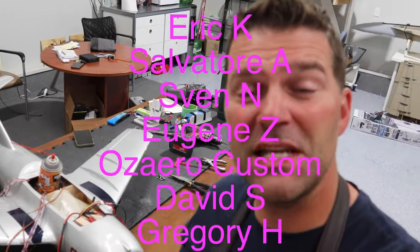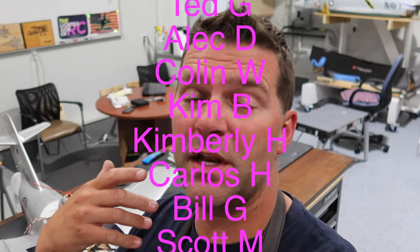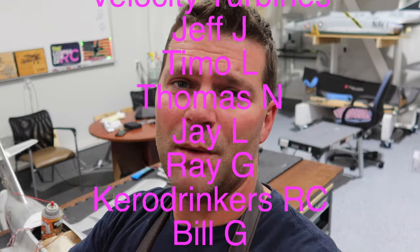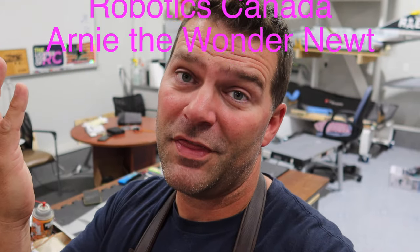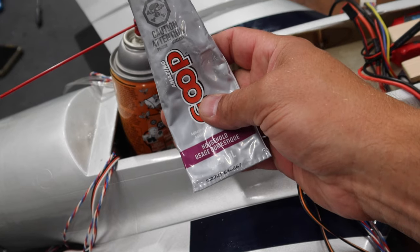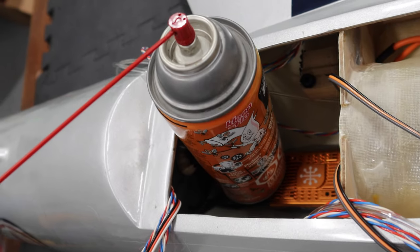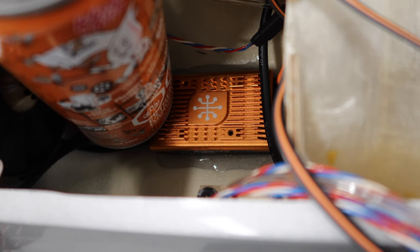Next issue is where to put this gigantic ESC. One of the only spots is down beside or underneath the fan, but there's no access with the fan and duct in the way. We slid the EDF unit back since the duct wasn't glued, giving us more room underneath. The Spektrum speed controller came with a fan mounted on top — I've taken that fan off because we physically cannot mount this ESC anywhere in the aircraft with it on. We're running an 8S setup on a 6-to-12S ESC, so it's not being overdriven. We're extending the middle cable using heavy-gauge wire so we can route the batteries to plug in from the front.